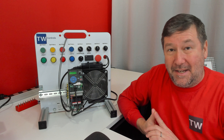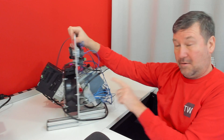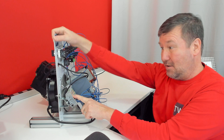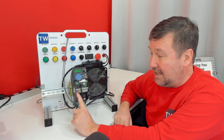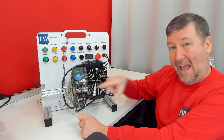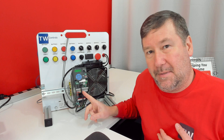The same basic question we ask ourselves in any electrical troubleshooting applies here as well: do I have current? Right now we're taking plus 24 volts from the power supply through the relay to our S1 and S2 terminals. How is it getting back to the minus of our power supply? This is where people usually freeze because they think they can't hook the common of this one to the common of that one — will it blow something up?